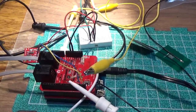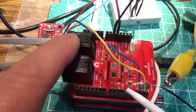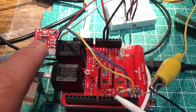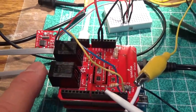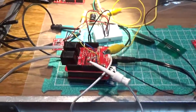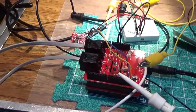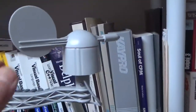For the weather sensor, we have the two RJ11 connectors with the wind sensor and wind direction coming on one port, and the rain gauge going on the other port. These rely on using interrupts so that we are able to keep track of what's going on even when the Arduino is doing something else.